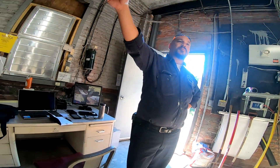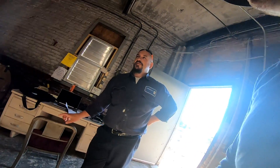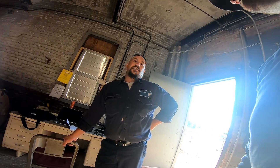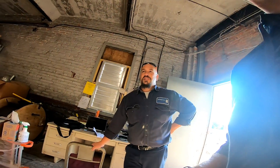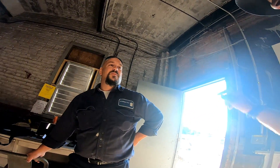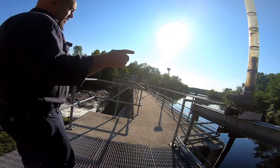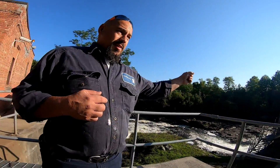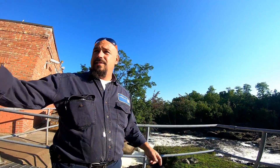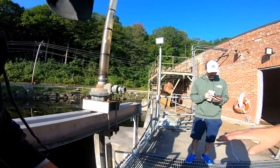This feeds three units and we make 30 megawatts that way. I walked partway down to make sure no one's in the riverbed before turning it on — last time there were actually people down there already before 8 o'clock. I just warn them and let them know the water's coming. Can we walk through here? We're actually at 120 CFS coming out of that gate.